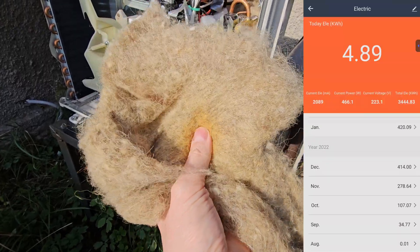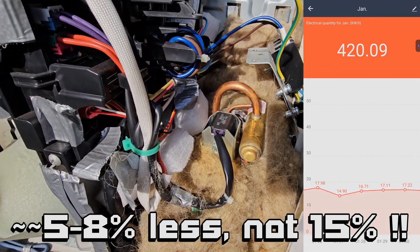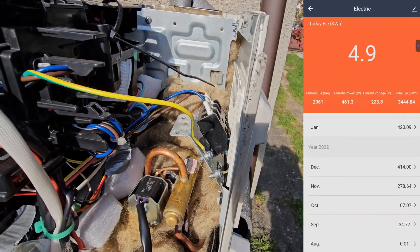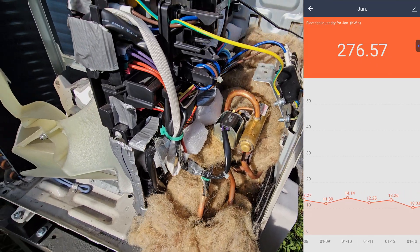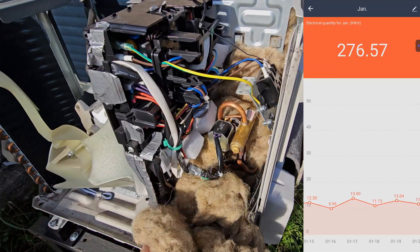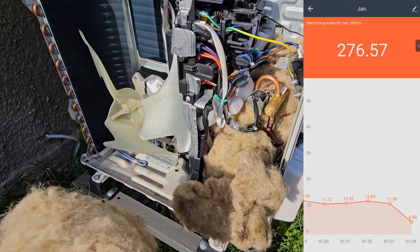Is it really working? In my case yes. I noticed that my split uses around 15% less energy, but in the real world this idea is more efficient when it gets colder outside. So if it's plus 5 degrees outside you will barely notice any difference, but if it's minus 5 degrees outside then the difference will be more noticeable — your heat pump will use less energy.